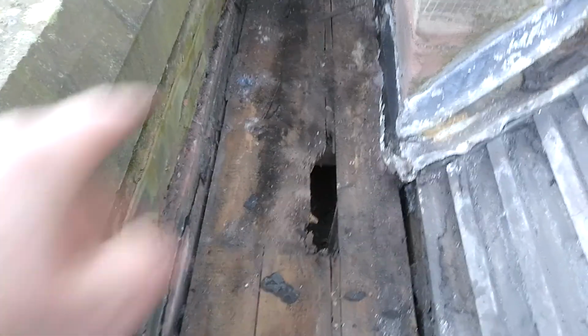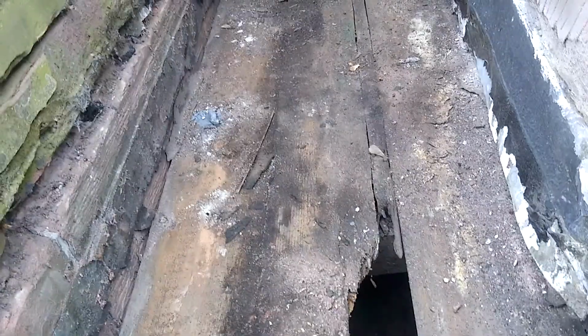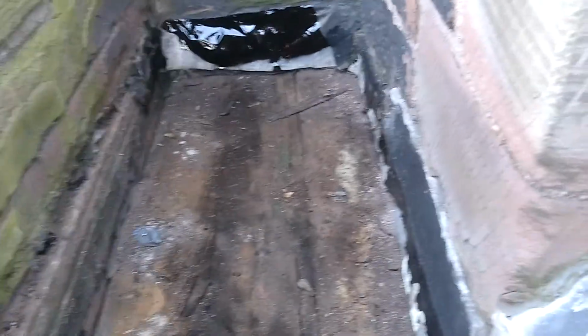And this, the very far end here, again, I've taken some still photographs. Some idiot had put nails into the felt. This was felted, and he'd nailed it down, so it was always going to leak. So that's been leaking for a long time there. So we've got some superficial damage to the upper boards, but the cross joists here are absolutely sound. So fortunately we don't have to do structural repairs up this end, and therefore we're not looking at extending the budget. We haven't found anything to particularly alarm me thus far anyway. But we can't leave that like that.